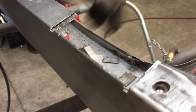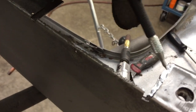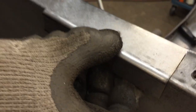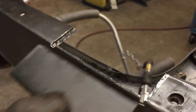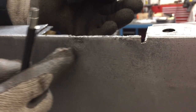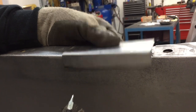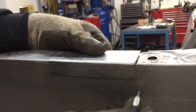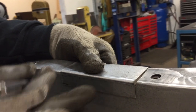I got this cut away and this metal here looks pretty good. What I decided to do was leave this sticking out a little bit — this piece fits in between, which will give it support on both sides. Now I'm going to scribe along here, then carefully cut this out and sneak up on it until I get just the right gap I want. When I get that done I'll scribe it, get it all cut out, and when we come back I'll show you how we fit it in place.